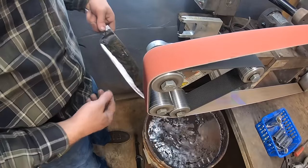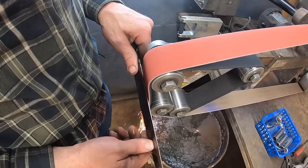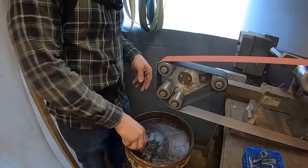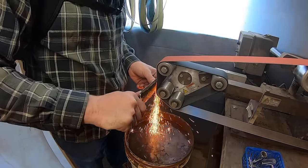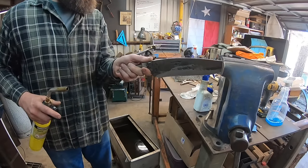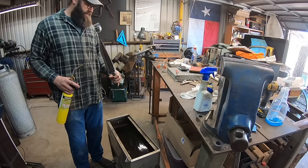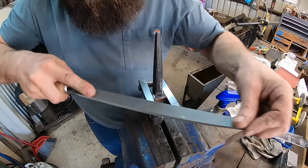I got the profile cleaned up — I didn't do any grinding prior to heat treating. It's all tempered up and ready to go. I put a nice hatchet grind on this big boy with the slack belt attachment from Beaumont Metalworks, which I use for my axes and hatchets and on big choppers like this. I had a little straightening issue out of the quench, which seems to happen to me on 5160 nearly every time. Just warmed up the spine in that spot and got things moved over — not a big deal.